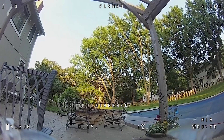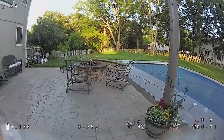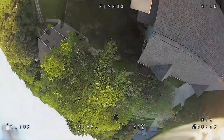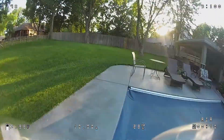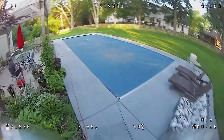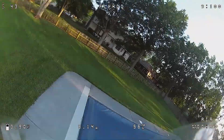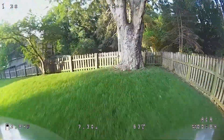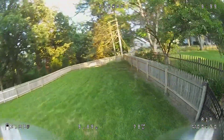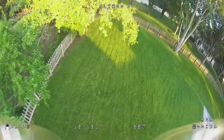Got a really nice, calm evening. I have overlaid the Betaflight OSD onto this video recording — this is not how it records out of the goggles. You'll notice that little jump right at the beginning; this thing really wants to take off. So if you're flying this with AirMode on, as I am, and you arm, it will want to lift up off the surface. You may also notice there was a little bit of vibration — the table I'm sitting at has a glass top and it's not very thick. When I bump the table, there are some vibrations. Most times when I take off from that table I did get a little bit of those bobbles. That's an indicator, at least in my opinion, that our PIDs are a little bit too high in one fashion or another.